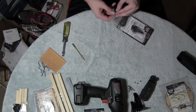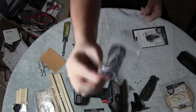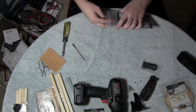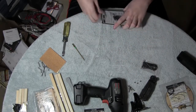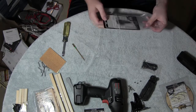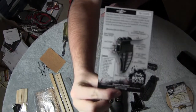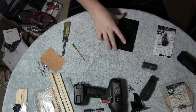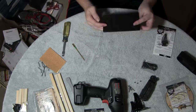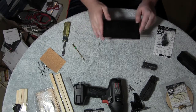It's a little bit more complicated of a build. This is the only downfall really of a tricopter, is you do have all these little push rods, and you end up having to have a servo to tilt the back disc and the entire motor, and that's how you get your yaw control. And it's not something that you really want to skimp on, because being able to steer your tricopter is a good thing. So again, same deal, just a lot more pieces, a lot more complicated. So I'm going to do the same thing, pop out all these pieces. You can see there, they're already pretty floppy from the laser cutter that they use. I'm going to go pop out all these pieces, and I'll get back to you when I'm ready to start building.